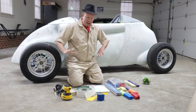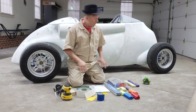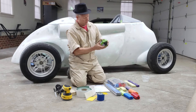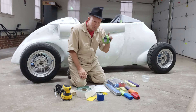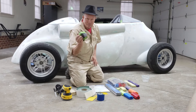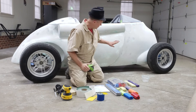Once the plaster was initially blocked out and fairly smooth, I continued with my bodywork tools. What this is, is guide coat — just like the stuff you use for bodywork. What you do is pat it on there and spread it all over — it makes a big black mess — and then you start soft sanding.